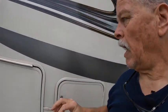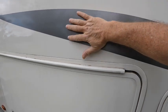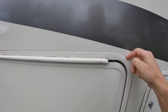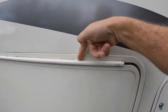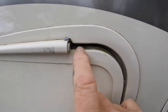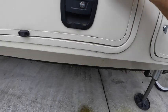I've really inspected this and here's what we got. Water condensation or rain will hit here and slide out - this part is sealed with caulk - but this bracket here is not sealed, and the water will run down into this area. As you can see there's a little bit of green there, and it'll come down this way. You can see how it's green there because water is trying to get in.